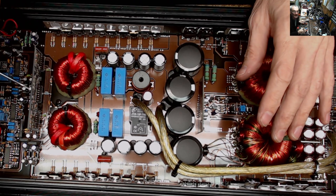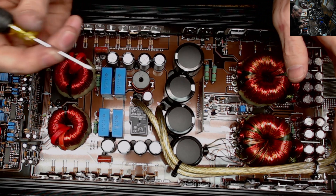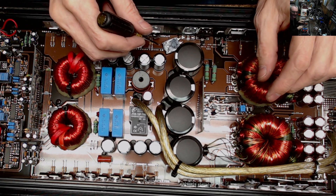As I back these transistors off the heat sink, you'll get used to the sound they make and you'll know when one's broke — at least one leg. And look at that, another rectifier fell right off.